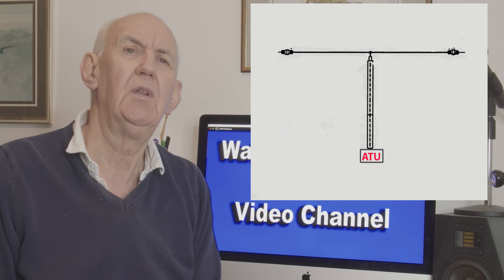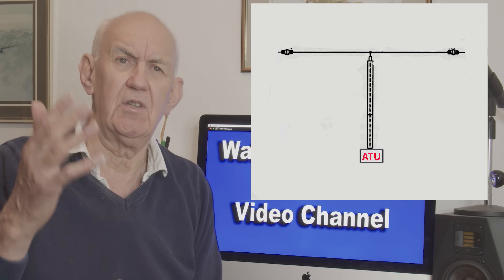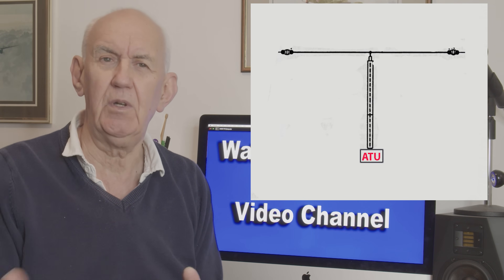So what does this box actually do, and why do you need an antenna tuner unit at all? Your transceiver is designed to work into a 50-ohm load - that's why we use 50-ohm coax. If that transceiver is connected to a 50-ohm dummy load it delivers all its power, there's no reactance at all. If we erect a simple single-band dipole in the garden and feed it with 50-ohm coax, we've got a pretty good match - not perfect, but roughly right - and you get a very low VSWR. The transceiver is quite happy and it doesn't need an antenna tuner unit at all.